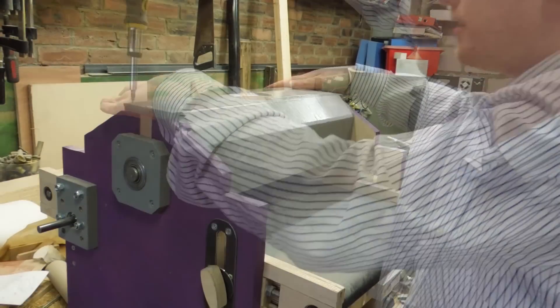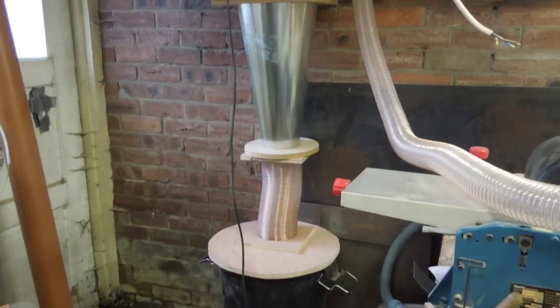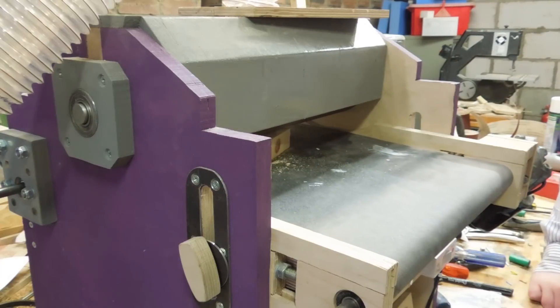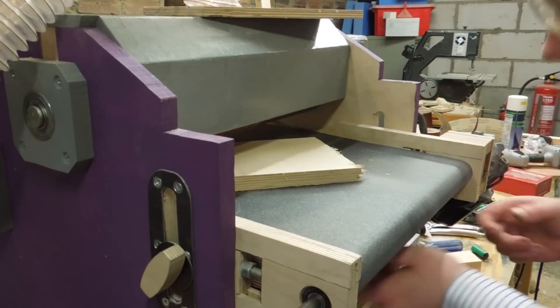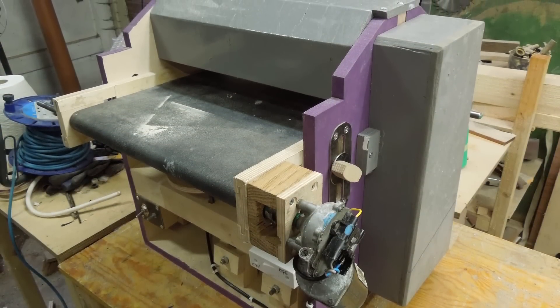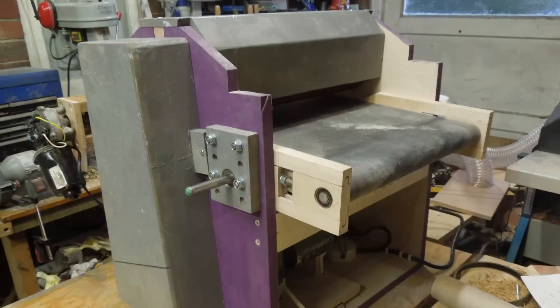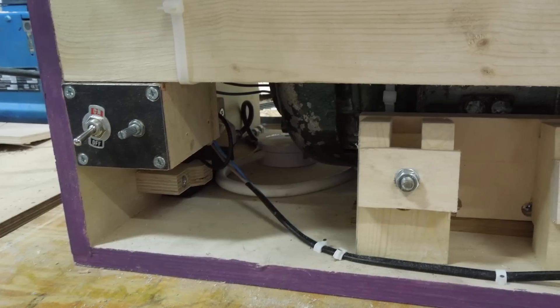The dust hood and belt guard were then attached to finish the sander off. I built this dust collector a while ago — it's still not finished but I could use it to test the sander. And right away I learned a lesson: turns out small pieces don't sand too well. Glad I was standing out of the way. I had less problems sanding a wider board; I think to sand small parts it would be a good idea to attach them to a larger board first. And that's the sander more or less complete. It took a lot longer to make than I expected but so far it seems to be doing an alright job. One problem I've noticed is that the speed control MOSFET gets quite hot when running for a while, so I need to sort out some decent cooling for it. But aside from that I have not noticed any other problems so far. I guess time will tell — anyway, thanks for watching.